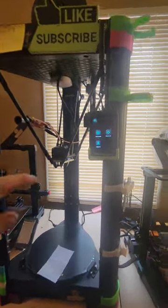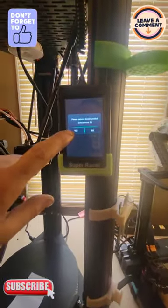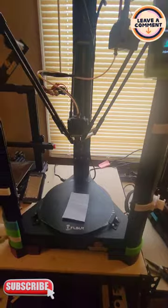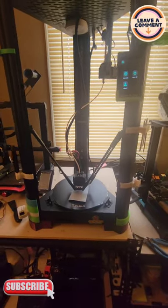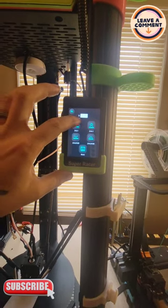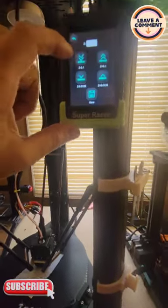What I mean about always ending on a downstroke — remove the leveling switch so the Z is gonna drop. We got 60 seconds so I'm gonna try and do this super fast. It's down now, it's way out of whack there. So you go to adjust Z and we're gonna drop it — 0.01 — we're gonna drop it to like 2 and then we'll fine-tune it. So we're almost there, gonna go 0.125 now.